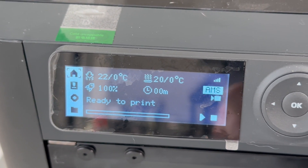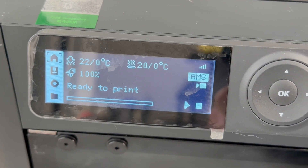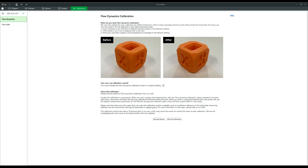The last thing we're going to do is go over to the computer and do a calibration to make sure that it prints well. We're back in Bambu Lab Studio. In theory, you probably don't need to do this if you're putting on a 0.4 millimeter head because it's already pretty well aligned for that, but it's probably still best to do. If you're swapping out to something like a 0.6 or 0.8 or something else, then you definitely are going to want to do this.